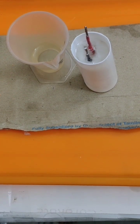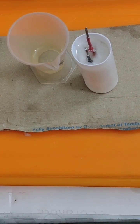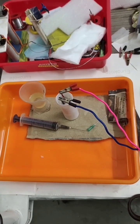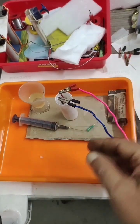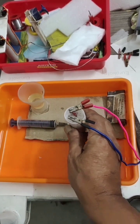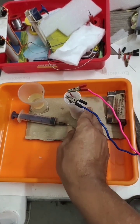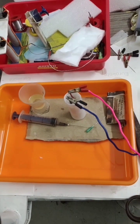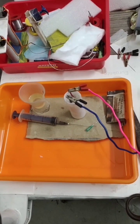I will keep it for one hour minimum. You can see the bubbles because the formation process is going on. First formation — I am charging at 0.5 amps, 6 volts. After formation one hour I will stop the DC supply to the battery, then discharge using any external appliance like a motor. This is the same process followed with other lead acid batteries.